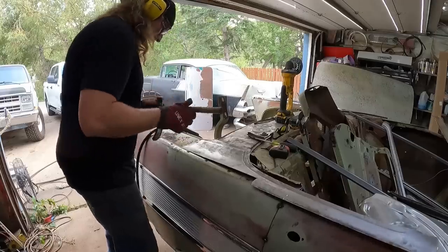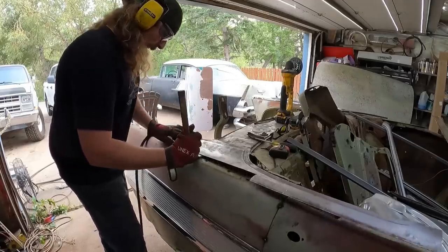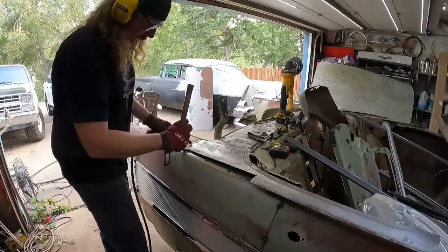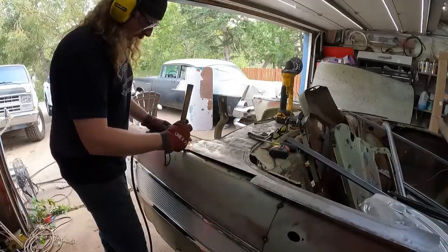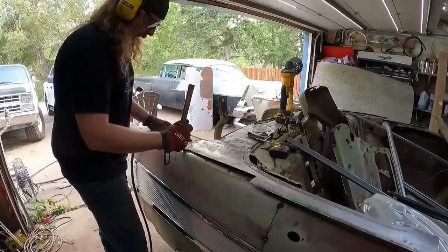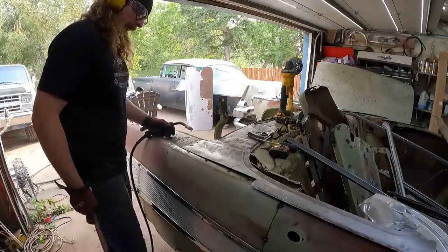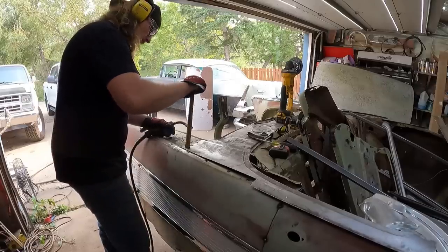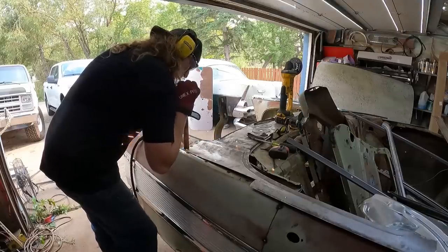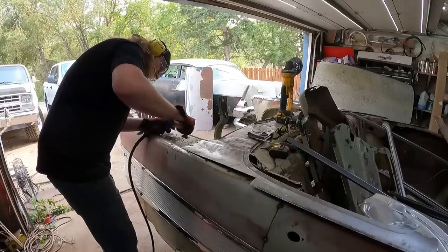Anything you have available. Hold the metal at about the spot you want. So you might have to pry it up a little bit, so the center will match. Watch this little trick. So now we got the center flat. The end is too high. Push it down. Metal likes to bend. Not fit.